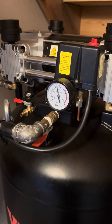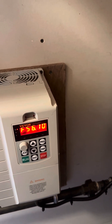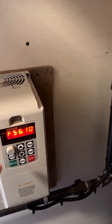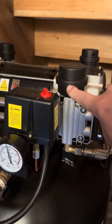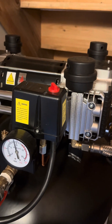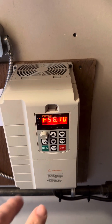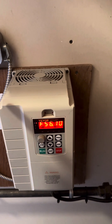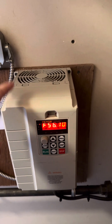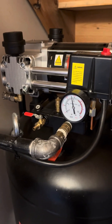If you wire that third leg with a reverse, the motor will run in reverse — you can see there's an arrow on here. We started at the lowest RPM level and turned it into run mode. We noticed that the exhaust port was creating vacuum, which meant it was running in the wrong direction. There are two options to fix that: one is to reverse two of the wires on the three-phase output, or what we did is go into the programming, change one of the parameters for reversing, and reverse the polarity on that output — and it worked perfectly.